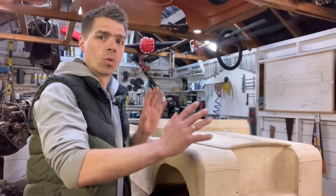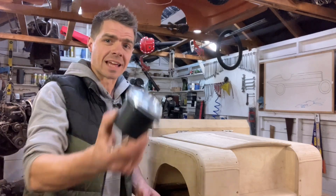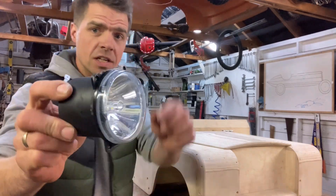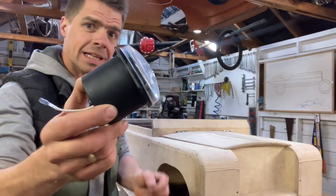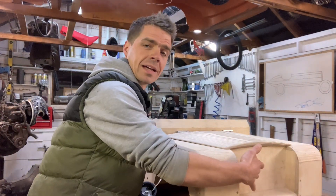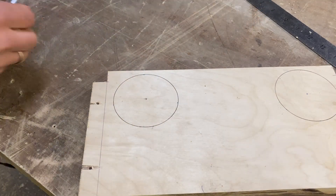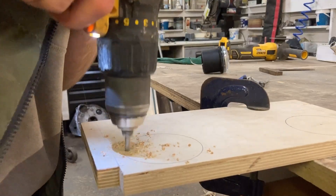And that is basically all of the carpentry side of this done. The very last thing I need to do is fit the headlights, which have finally arrived. As you can see, they have this little lip on them and they mount from the inside. So I need to remove this radiator panel, rout these in, do a little housing for the fixings to go into, then I can glue and screw the panel back in and then I can start painting.